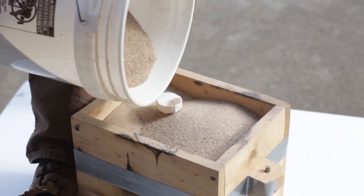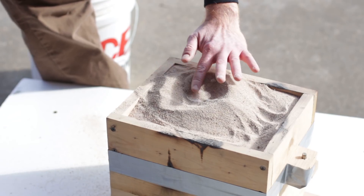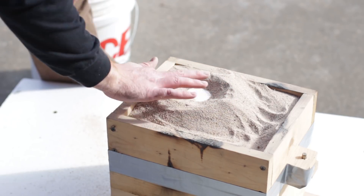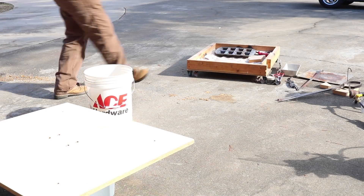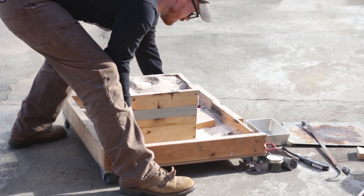I made a foam pattern similar to the way I've done in previous videos, put on plaster of Paris refractory coating, embedded it into a flask with sand using my vibratory table, then took it over to my mobile sand cart for casting, melted the aluminum and poured it.